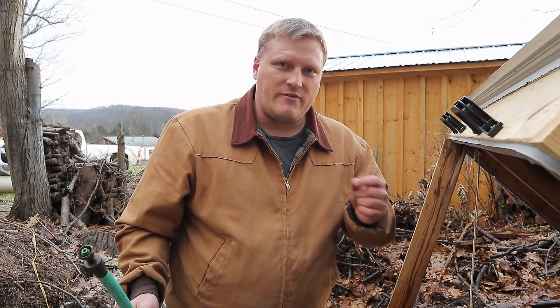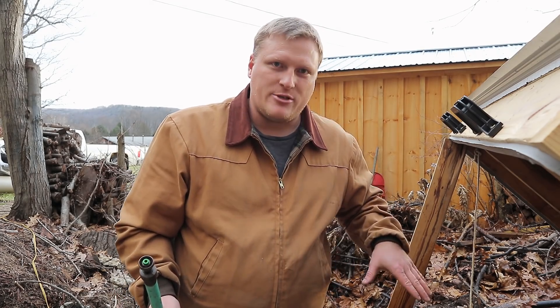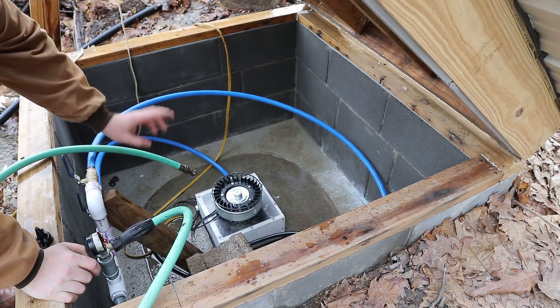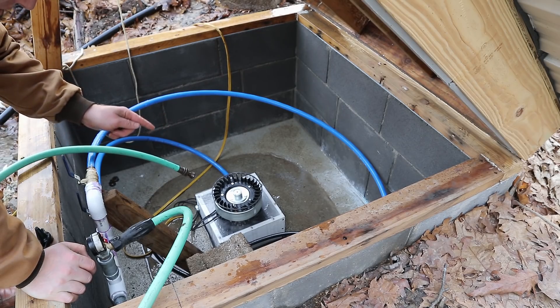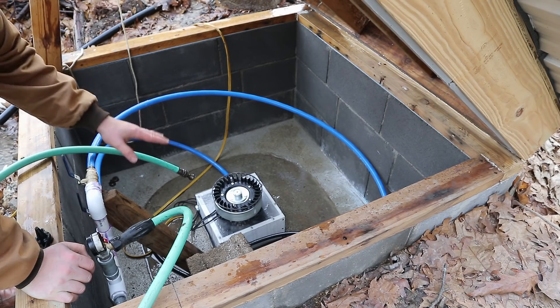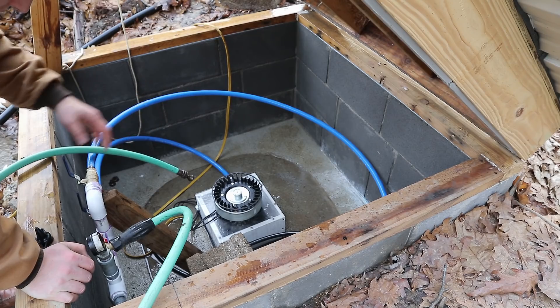For that reason I have to be very careful about the amount of water coming through here so I don't drain the line, suck air, and damage things. Since we're done here, I'm going to turn this back on with the small nozzle — that's all it needs to run, and it was running just fine with it. It's doing about 150 watts continuous output, and you can kind of hear it modulating because the charge controller was turning on and off since the batteries were full.